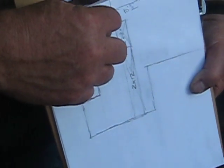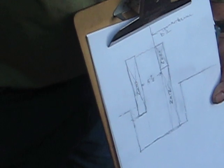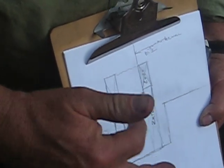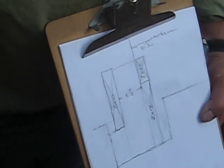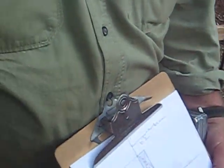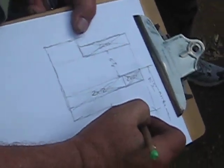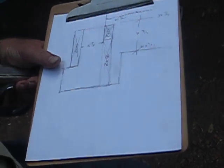This is the most important point. What we're laying out is the top of this little two-by that we've got here. This one goes on the outside because we want the concrete to slough underneath and go against the dirt on the outside. What we're establishing right now is that point right there and our string running all the way around at that point. That's the inside model. So we need another string once we get these lines up.